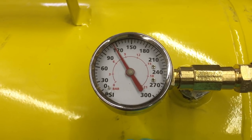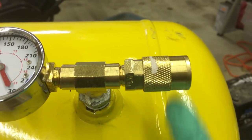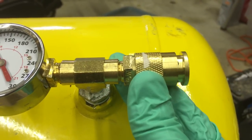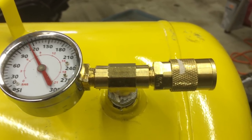This tank only holds 125 PSI, so this gauge is very sufficient. Then I put a female air receiver here — I also got that at Home Depot — so I just carry a shortened air hose with me with an air chuck on it, and also a blower chuck so I can use it for whatever I need.